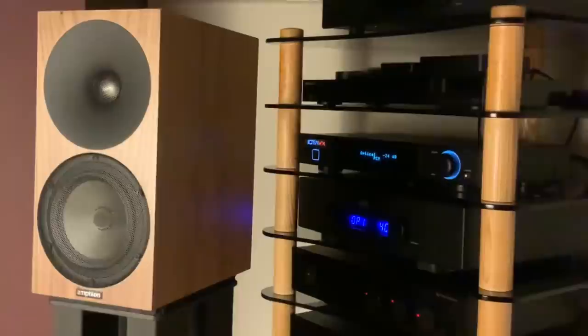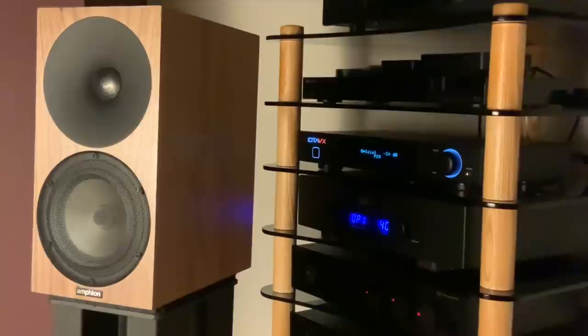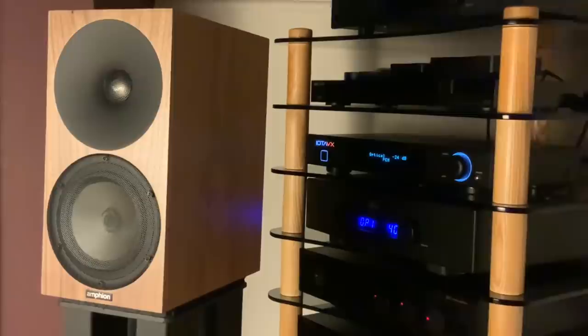There are always engineering trade-offs, so what's the downside? Well, when it comes to the woofer, the woofer's pretty happy. You've set the crossover point at 1,600Hz, and even with a relatively gentle slope of 6 or 12dB per octave, it's not playing in a region where it's going to be adding a lot of distortion and those breakup nodes are going to become a problem.